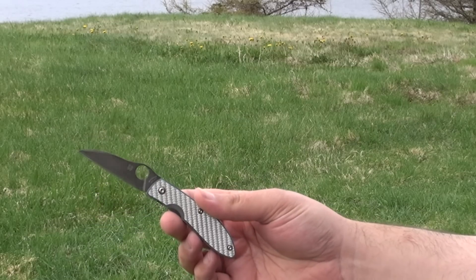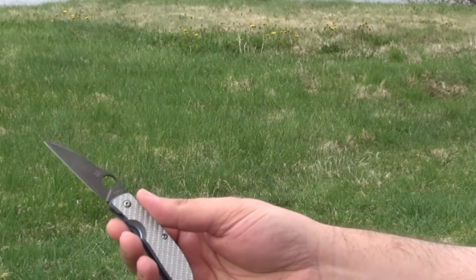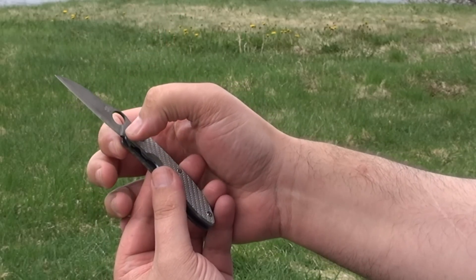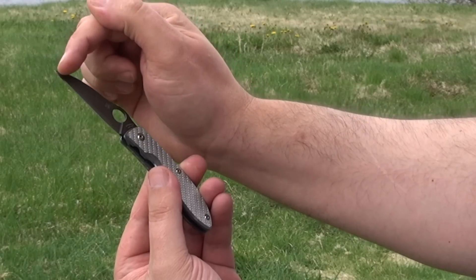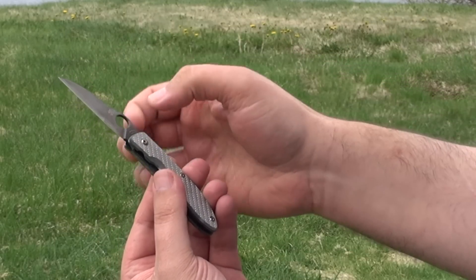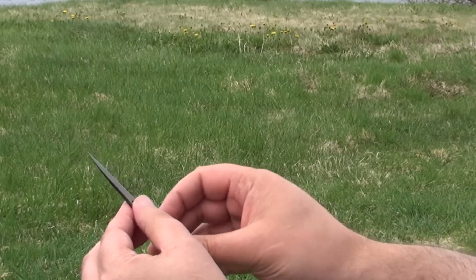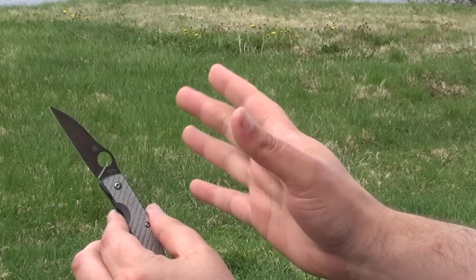As an aside, a few comments about this knife. Some things I really like that are not overly common features: you can see the way the blade is dropped very, very slightly. What this does is prevent the need for a sharpening notch or choil, but it acts very similarly in that you get smooth sharpening right back to the start of the edge for quite some time. You don't get that blunt spot or little recurve that can develop in edges that go all the way back but don't have a sharpening notch or choil. Very thin blade stock, high flat grind, high speed steel — not much to complain about there.